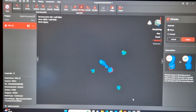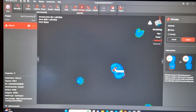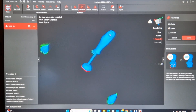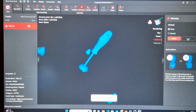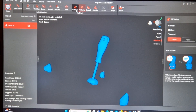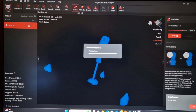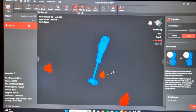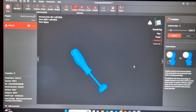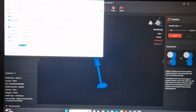This is me covering the holes — you can detect the holes, click them, and select them. I'm making sure I get all of them and ignoring the Blu-Tack mounds I've put around to help with tracking, because I'm going to be removing them in a minute anyway. There you go — that's all the holes covered and this is now one meshed object. I isolate those little Blu-Tack triangles, turn the value up so it detects a bigger object, and it highlights them in red. I apply it and it removes them, leaving me with the actual scanned part. Then I export it as an STL.